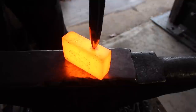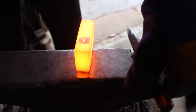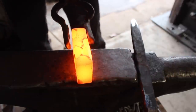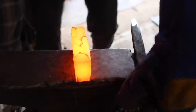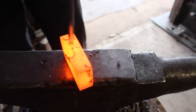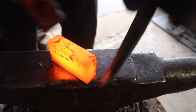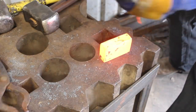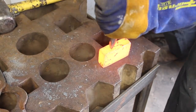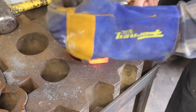I'm starting out slowly and carefully to make sure that I have the punch started where it needs to go. My billet was actually a little bit cockeyed and not sitting quite straight up and down, so I had to fix that real quick. Once I have the punch started, I'll move to my lower striking surface, which gives me a lot more ability to get more power into the swing of the hammer and get more work done quicker and easier.